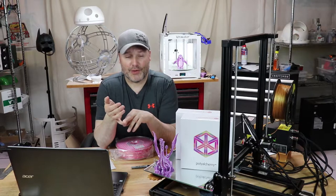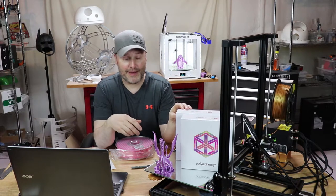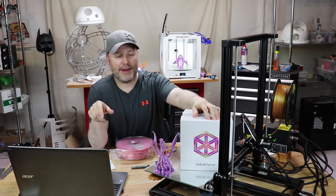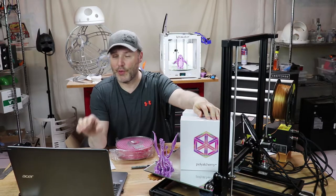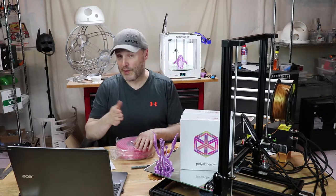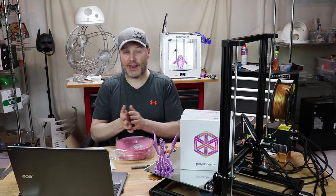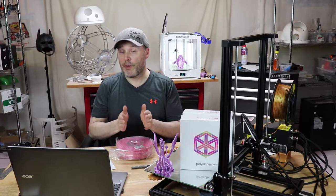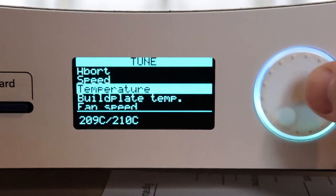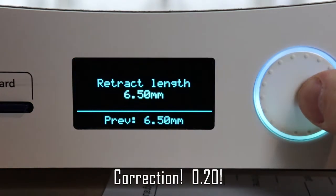Let me tell you about the print settings I've been using. I bought the 1.75 millimeter — that's going into my CR10s, my Tevo Tornado, and the FT5. And then I bought the 2.85 for the Ultimaker. I've been using Cura and also Simplify 3D. When I'm doing experimental new things with filaments on the Ultimaker, I like to use Cura — Ultimaker knows their printer better than anyone. I started with the Ultimaker PLA profile for temperature settings and retraction. I found that doing the first layer at 210°C gives a really nice even layer, then I lower the temperature down to 200°C for everything after layer one, and I've increased retraction distance by a tenth of a millimeter.